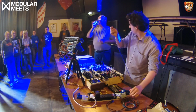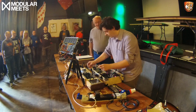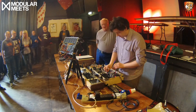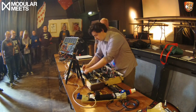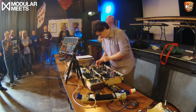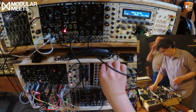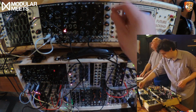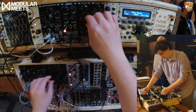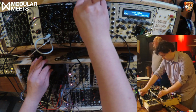Talking to Roy yesterday, how long ago was it that you were playing with several of these filters in parallel, doing things like that with it? Oh, this goes back, I think, 2009. I was dabbling with the idea of a Gristleizer reissue, and I got rather sidetracked into doing the filter differently, and I ended up with three of them in parallel, single signal source, split that way, three filters, and then mix them together, so you've got three peaks that you can move around. And then I was playing around with vocal formants and looking up the three filters will give you a very vocal sound if you move them in the right way. Then I had a table lookup for male, female, and child voice for the formant frequencies. What really stopped it was that it needed software, and that takes time to write, and I never quite got there, which is why the 2009 reissue did not meet its release date. Still hasn't got any further than that. Sometimes things like that happen for a reason.